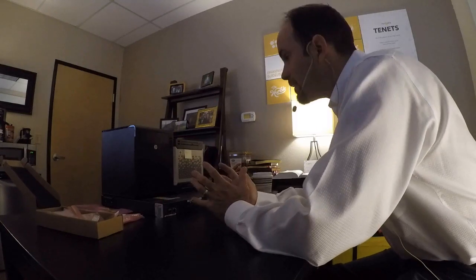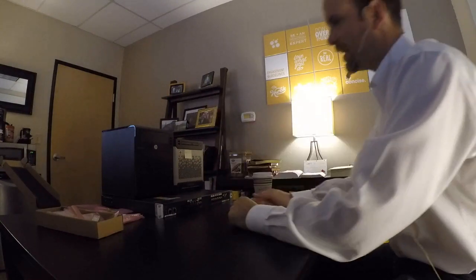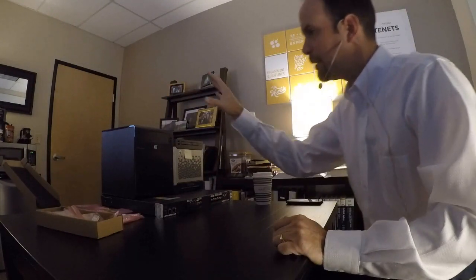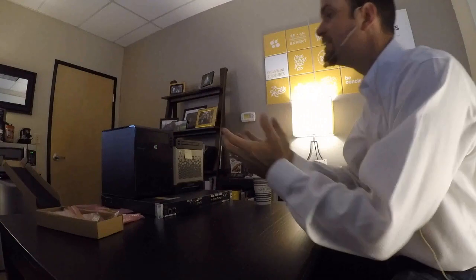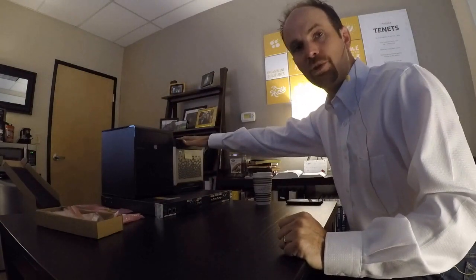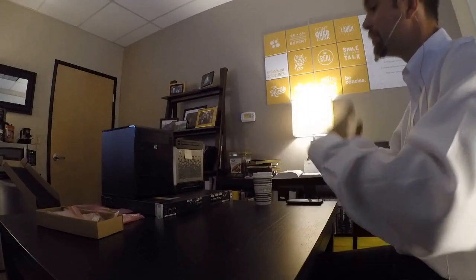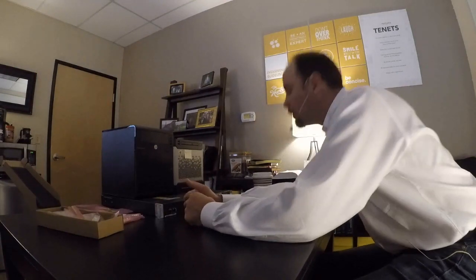Here's what I've got to build our Fiber Channel Lab. First off, a couple of HP microservers — just some servers I had sitting around, an old one and a new one. One of these will become the Fiber Channel Target, and I'm going to set that up with some Linux software to present it as a Fiber Channel Target. The other one is going to be an ESXi server running VMware, which will connect to that storage and use it. Underneath is a Cisco MDS9124 switch.